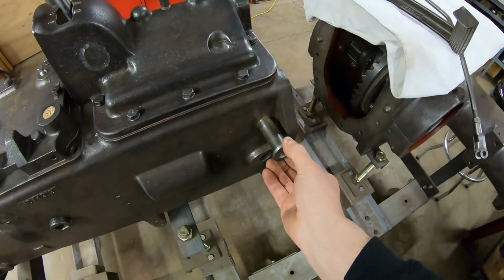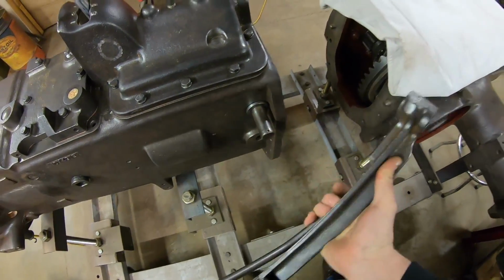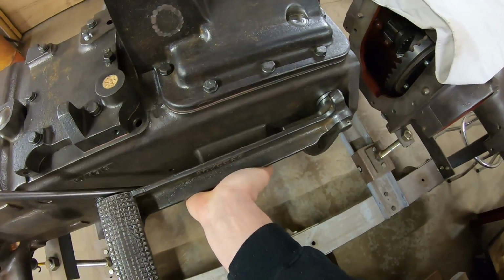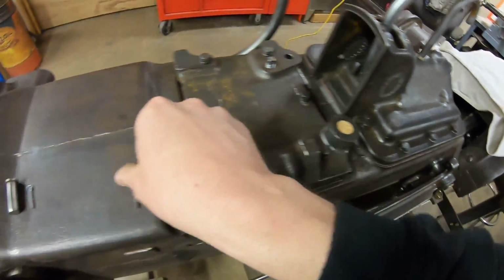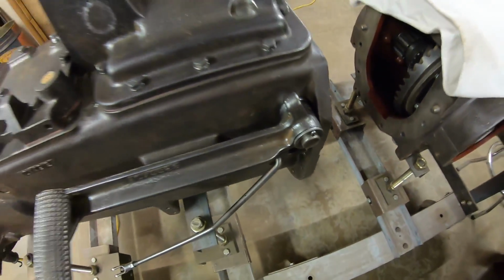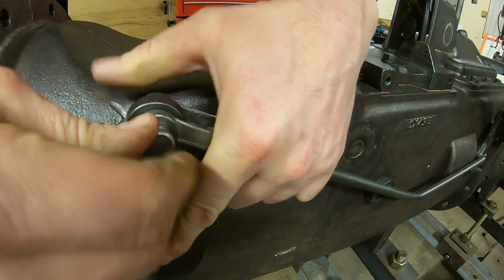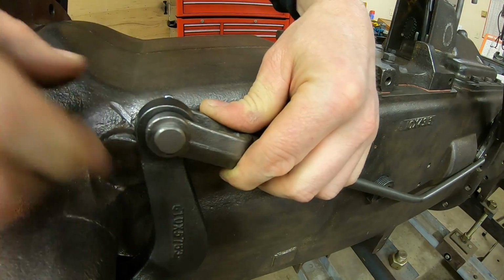The thicker spacer washer goes on the peg first, and then the pedal, and we are not going to grease this pivot yet because this is mock-up only at this point. When it comes time for priming, painting, this pedal will be taken back off. Thinner washer goes on the outside, and new cotter pin holds it all on the peg. And finally, the linkage rod connection. Two hands required for this step though. Line the pin and just drop a cotter pin in for now.